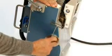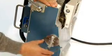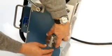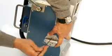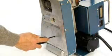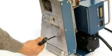Adjust the wedge until the correct distance is set, then rotate the disc so it locks into place. Hold it down while you disengage the wedge and secure the hex screws. With the material still locked in place, adjust the wedge until it's centered between the 2 nip rollers.